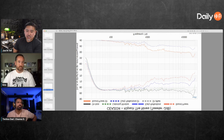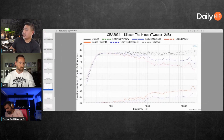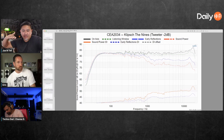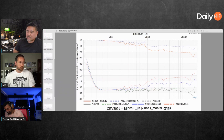Here's the Klipsch - this is mostly the vertical. From experience, I've done calibration for some people with Klipsch speakers. These are powered with DSP already flattening it out, but normally the trouble is they have a rising treble response on some of the passive speakers, so I typically try to turn that down and make the on-axis and listening window more linear. But then people say it sounds a little too dead, not enough treble. Why? If I flip this and look at what happens to the directivity index when I make it flat, well the off-axis is going to have way less treble.